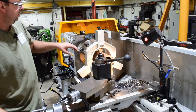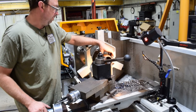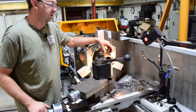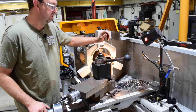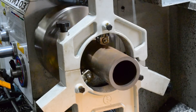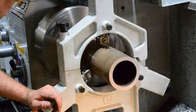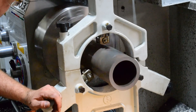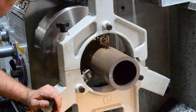Now, last week we turned the bore on our receiver tube to 4.474, so we're going to actually make this 4.475 - a one thou fit - and that should be good for his application. See how we look and touch our steady off. A little wobble there, but it'll come out with the steady rest.